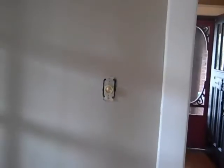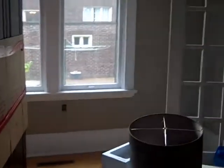Now when we come into the dining room area, we've got the textured ceiling, and as we come around, we've got the switch here on a dimmer. So in this case, we will need to make a few holes, mostly just around the top area, and hopefully the joists are running accordingly so that we can access the lighting without interrupting too much of the ceiling.